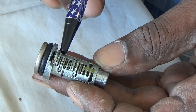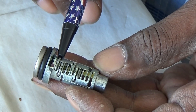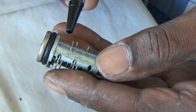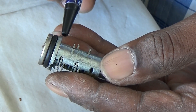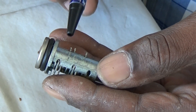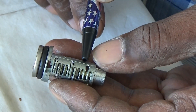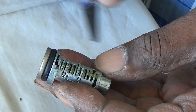It's not that the plug is any shorter. The reason why you have a different code is because the number of tumblers in the lock differs. The depths are the same. The spacing is the same. The difference is the number of tumblers. There's no different part number as far as the plug or the lock is concerned — it's all the same.